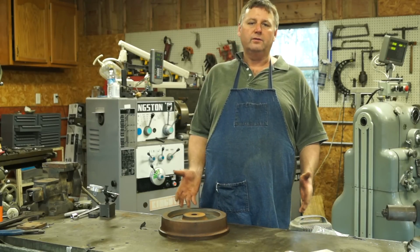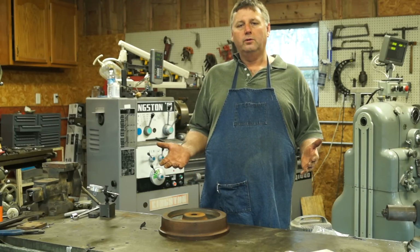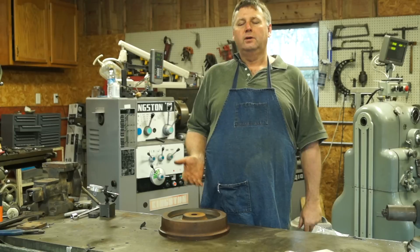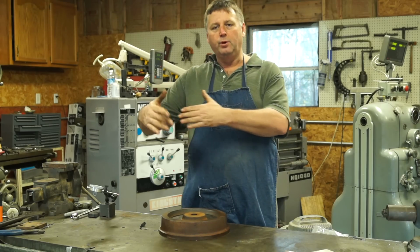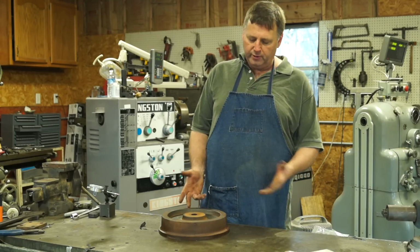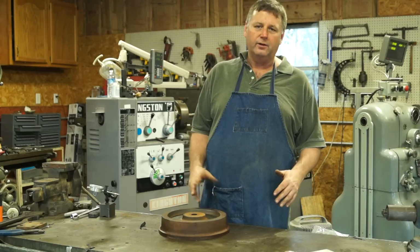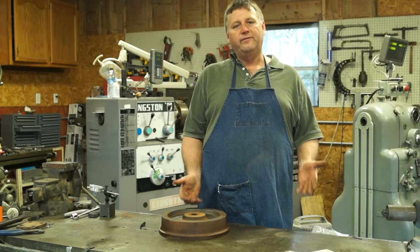And the biggest reason is, if you know about CNC and you know about mills, you understand the mill only moves in 3 axes. It moves X and Y, so when it makes a circle, it has to calculate that X and Y move all the way around. To do that, I think the program we wrote for it was 130,000 lines. That was done in Mastercam, and it could have been done simpler. It could have been done with a radius and canned cycles and things like that, but still it wasn't efficient.